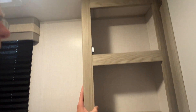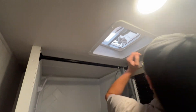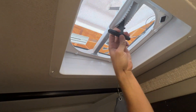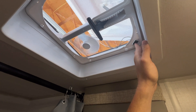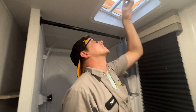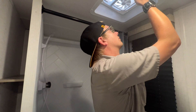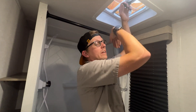Up here you've got a pretty deep medicine cabinet. You do have a vent fan up here — it is manual, so you're going to draw back on the handle, rotate the teeth to the desired opening. While it's open, there's a push-button fan that turns the fan on and off. It is recommended that you never turn that fan on when the vent is closed — that's just going to recirculate the heat and cause your motor to burn up faster. If you're going to run the vent fan, make sure the vent is open so it can draw plenty of air from the outside inward.